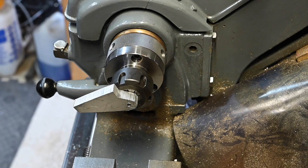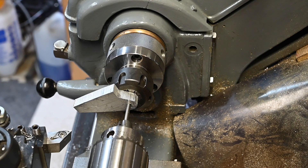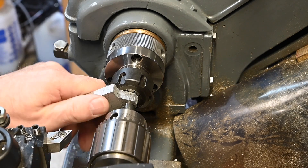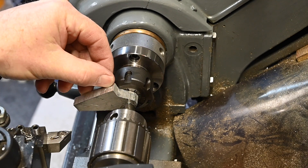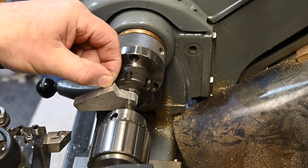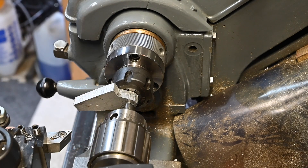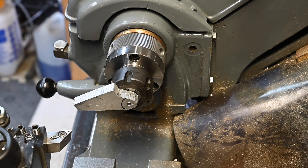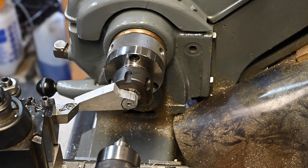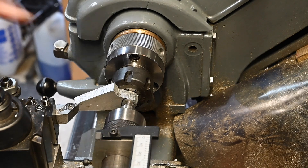Just to see how that fits. The reason I've decided to set it up in the collet is because I've got to mill it down to four and a half millimeters, which means there's only going to be about three millimeters in the jaw of the chuck — it's going to be hanging right out on the edge. So I'm going to try and do it in the collet and hopefully it'll work out okay. If necessary I can bring in the live centre straight off just to give it a little bit of stability, barely touching it.